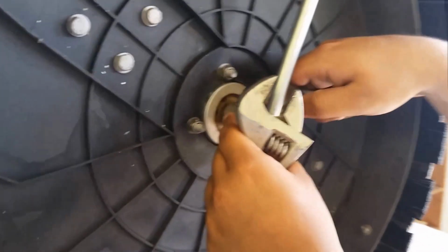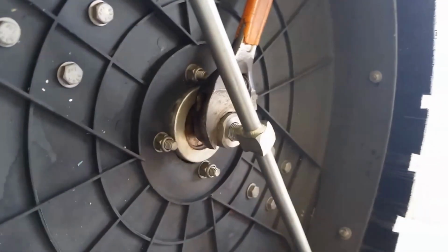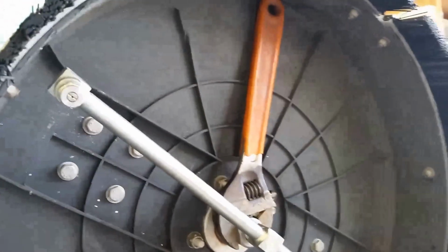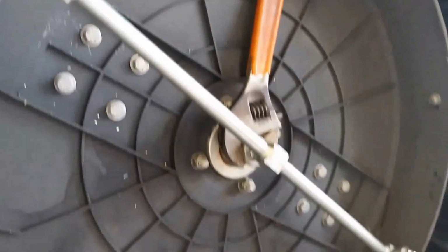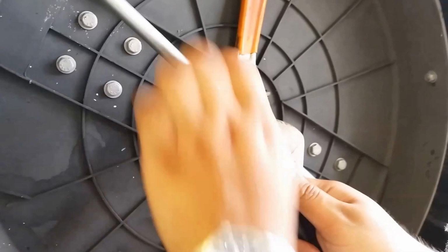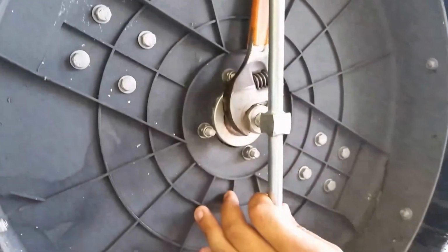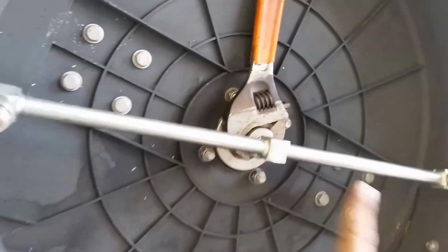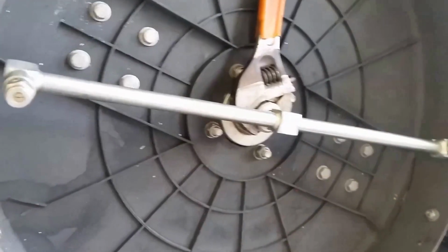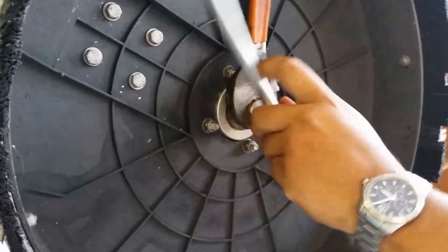On the swivel assembly itself, you'll see 2 notches where you can attach a wrench to it, and I like to use the grooves inside of the base itself to help me get a little bit of leverage there. I'm going to take the second wrench and apply it right to the bar and remove it like that. One thing you don't want to do is just take one hand and turn this like that. Very easily you will bend this bar and it'll be no good. You'll be looking at a replacement bar also. So we're going to go ahead and remove that.